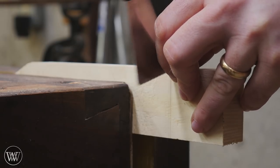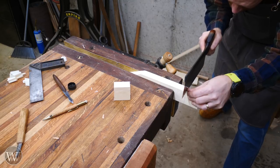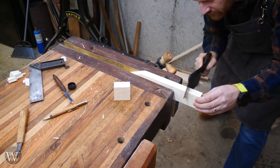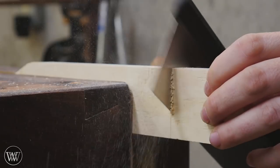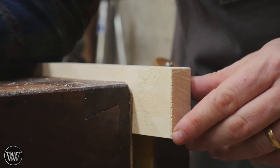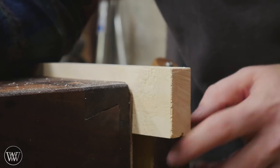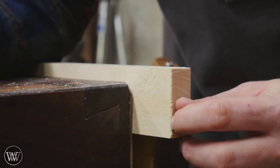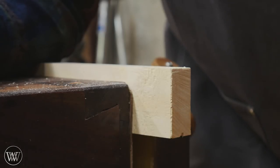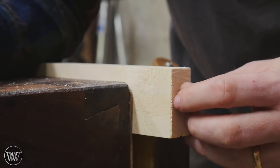The other thing I'm going to do is stay away from the line, because I can always plane back to that line or chisel back to that line. So what I've got here is I've stayed a good ways away from that line, and I'm going to come in with a chisel and clean out that mess, or put it on the shooting board and take it back to that cut I made. You can see how that cut is actually still very, very sharp — there are no frayed edges on that edge. Rather than using the pencil, you're using a marking knife, and that is creating a knife wall.